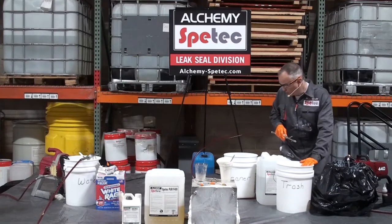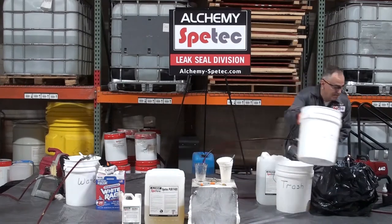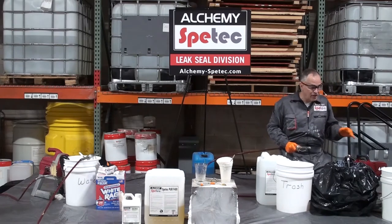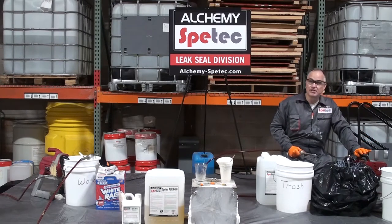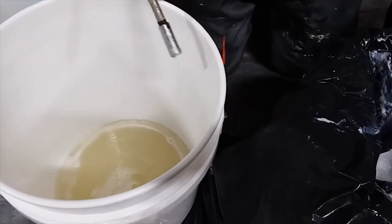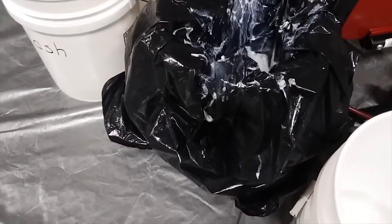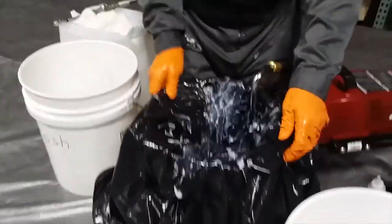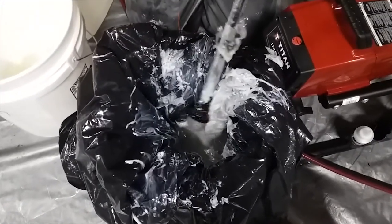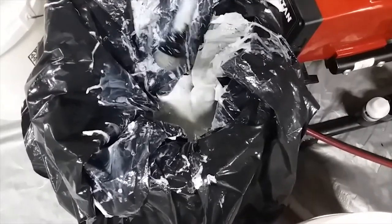Alright, trash bucket and cleaner. How much cleaner do we typically use? About a gallon a day is normal — that'll get you through starting up and shutting down at the end of the day. I'm going to turn this down, shoot to the side, open up and just depressurize. We now know we're depressurized. I'll wipe my tip, and remember the skin we talked about? There's our skin on top. I pull it right out, shake the hose a bit and wait until I don't have a steady stream — if you go into cleaner with a steady stream, you're putting a lot of free-floating grout into the cleaner.